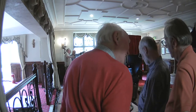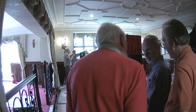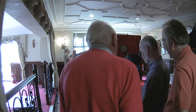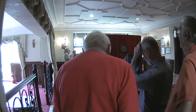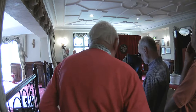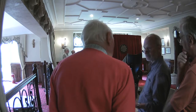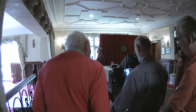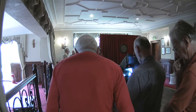Yeah, I see what you mean. Well, I did it by unplugging the viewfinder before. Yes, but if the camera was flashing, I don't understand. That wouldn't fix it. Right. The viewfinder might also be flashing. Oh, I see. So it's less light, and the hum might well be the viewfinder. Well, we could find that by unplugging the viewfinder, but that's not conclusive. Let me go and have a look. I'm not sure. I don't think we've got another one. What I'm saying is, I don't think I've seen any hum on the scanner picture. Right. Let's go and have a look. Yes, I will.